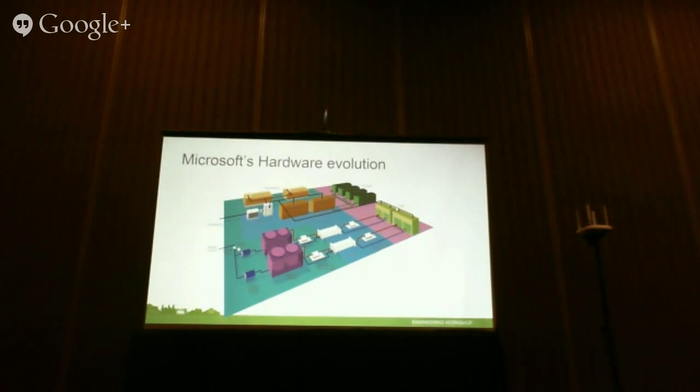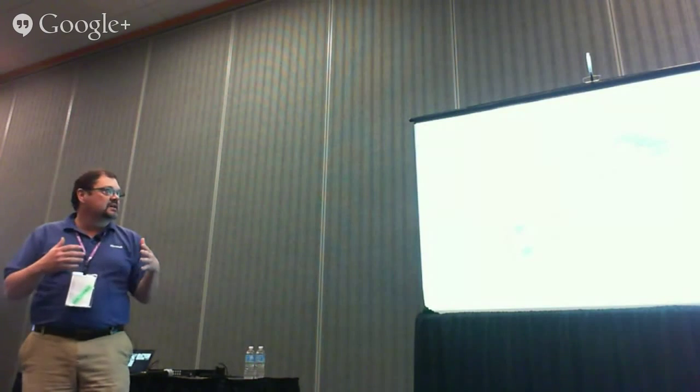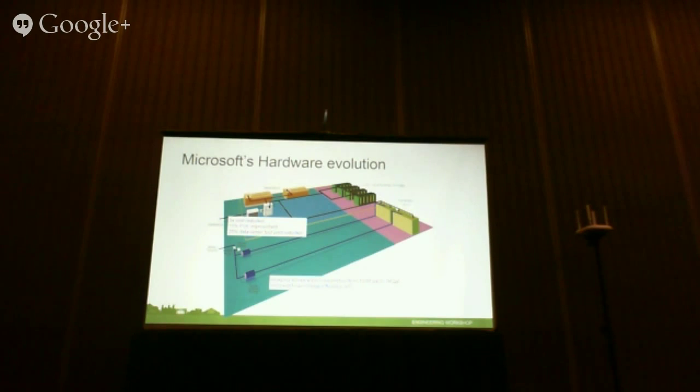So this is a cartoon looking at what a data center looks like. There's a water cooling part, this is the old design with CRAC units and louvers, and above that we've got generators and UPS systems and the IT load. We eliminated the chiller towers, the pumps, and the liquid cooling, and that saw significant improvements. When we removed the UPS, we're seeing a 5x cost reduction equivalent. We're seeing another PUE improvement of 15%, and we're reducing the data center size by 25%. I'll go into more detail.